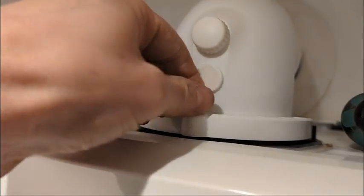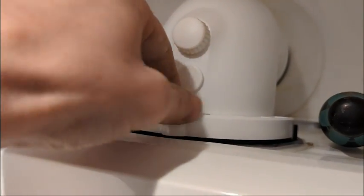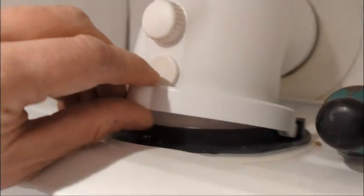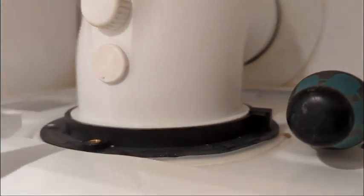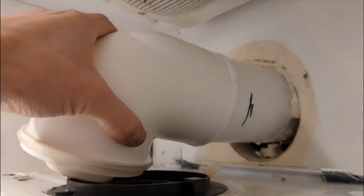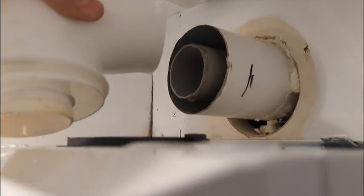I've decided it's the flue. Prior to this I actually had the flue off and checked it - I resealed the seals with a bit of silicon grease. I did actually get slightly better readings but they were still not perfect, probably just passable. But we decided a new flue was the best course of action. Right, so we're back at the job - let's get this flue changed.